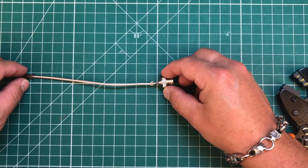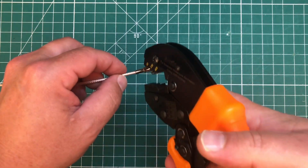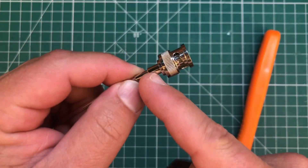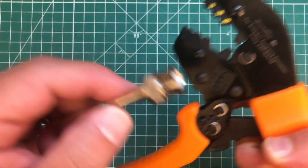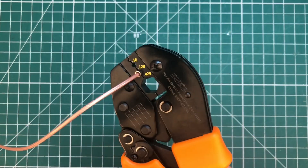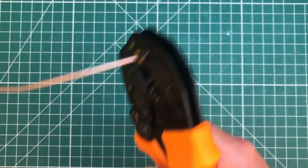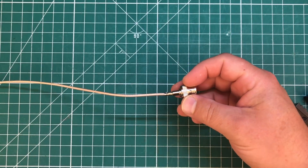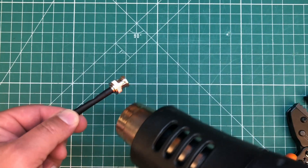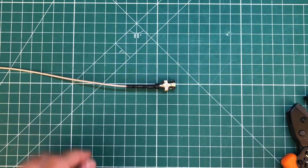Next, we're going to slide the ferrule up and over, then insert it in our crimping tool. You can see there's a wider gap for the wider part and the skinnier part goes in the skinnier side. We squeeze and that's it — very simple. I'll crimp this down here as well to make it easier to slide the heat shrink over. Slide the heat shrink over and heat shrink it, and now we have a nice professional-looking BNC installation.